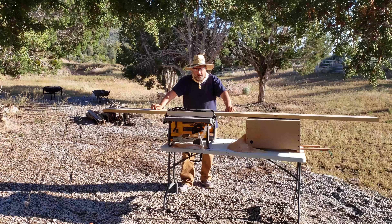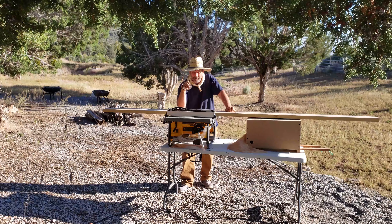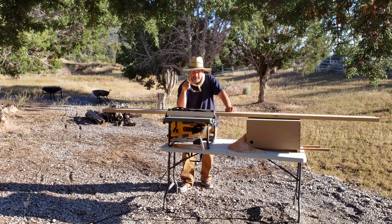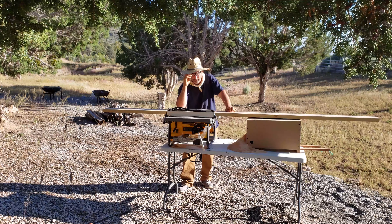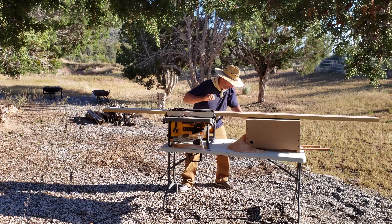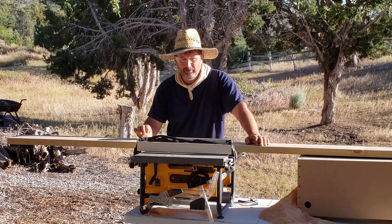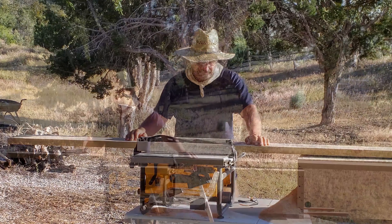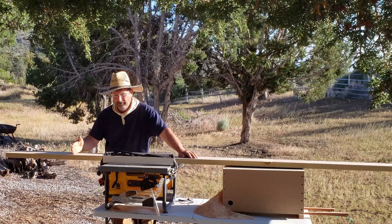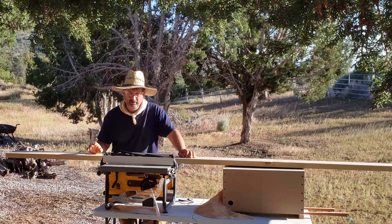There's something of a tradesman's lost-item theorem: the amount of time it takes you to find your safety glasses is directly related to the amount of time it takes you to give up looking for them and get a replacement - right in front of me the whole time. The cabinet carcasses call for an awful lot of pieces of three-inch wide stock and many of those pieces are only two feet or less. In terms of reducing waste, if I do my cross cutting first and then do my ripping, the leftover pieces will be nearly useless.